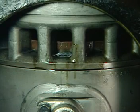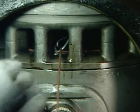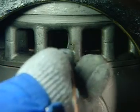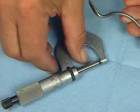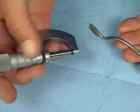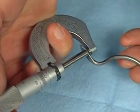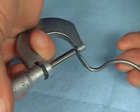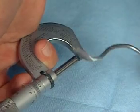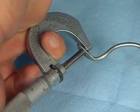Once the lead has been applied, bar the engine one complete revolution until the cylinder is once again at bottom dead center. Carefully remove the lead wire from the top of the piston through the liner ports. Using a 0-to-1 inch micrometer or vernier caliper, measure the thinner of the two compressed areas of the ends of the lead wire to determine the minimum piston-to-head clearance. The difference in readings between the two measurements of the compressed ends should be within the minimum-maximum micrometer reading of 0.005 inch or 0.13 millimeters for new, re-qualified or otherwise clean remanufactured parts.